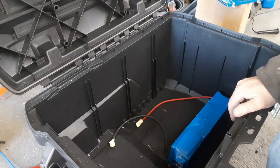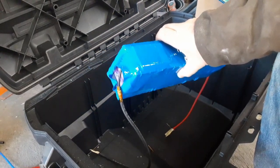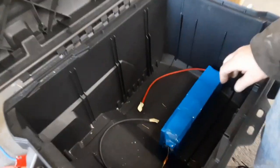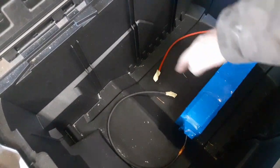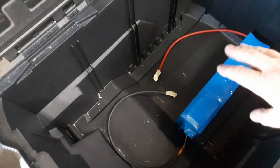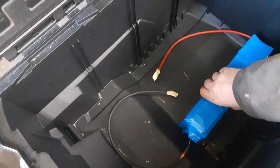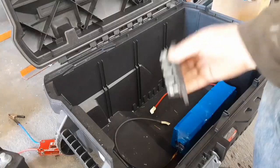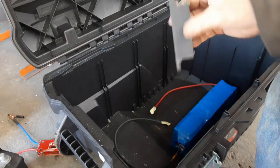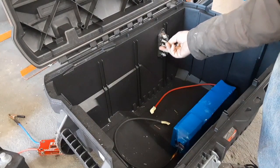Putting together the basic layout for the inside of the box. Here's the same battery pack I showed earlier with all the wires soldered on and shrink wrapped. If I configure them down in the bottom like this, it looks like I can fit three stacked. I'll put foam padding all around them — since this is mobile I want everything well insulated against vibration and impacts. Three of these will give me about 140 amp hour battery. The next step is to install my bus bars — I've got salvaged ones — one for positive, one for negative.